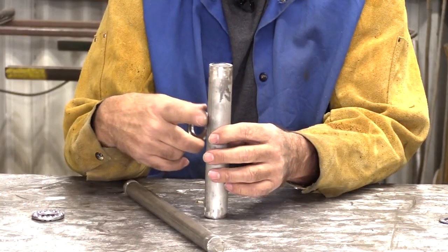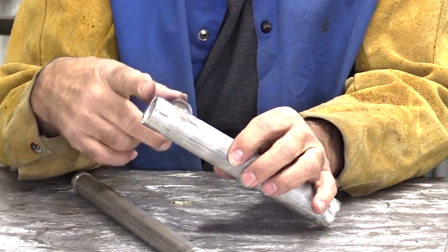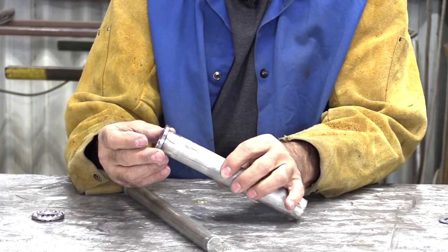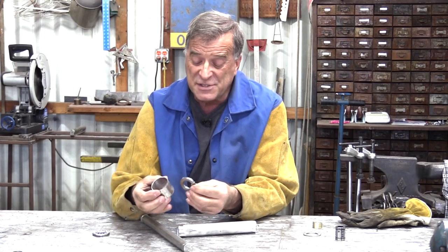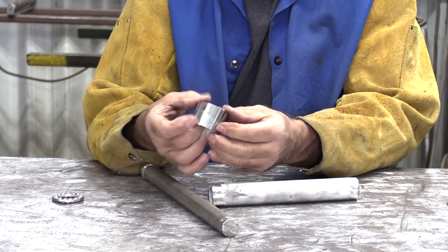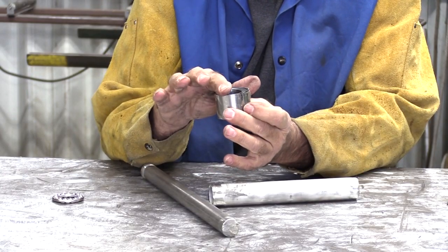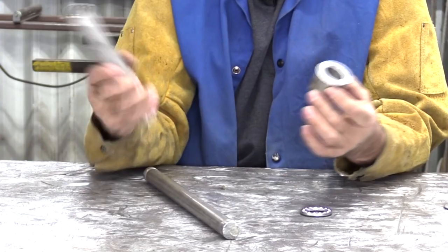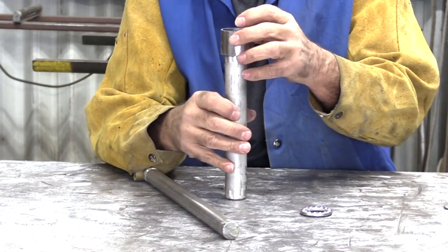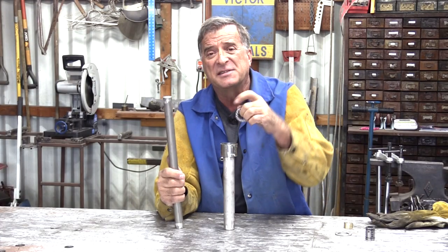Don't make the whole rock sit there and wobble. So you just take the stainless steel pipe, I'm going to true up this end and get it nice and square, flat, cleaned up. And I'm just going to weld my race right to the top of that pipe. And on top of the race, I've also cut this little collar out of stainless. Didn't quite get all the burrs out, sorry. But the race will fit down flat inside there. I'll TIG weld it all around on the top side. So I'll have a sealed unit, if you will. Once I get this welded onto the top of the pipe, the bearing will fit down inside into the bottom race.